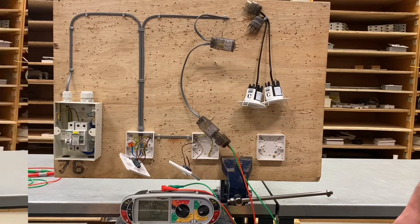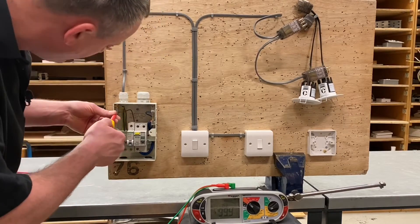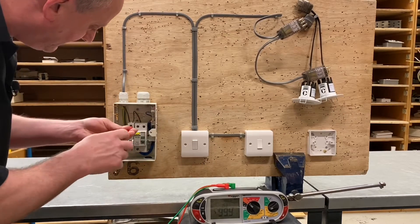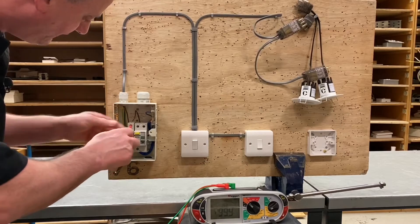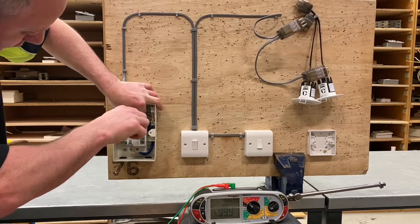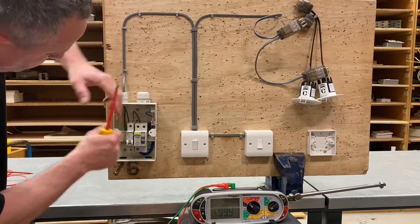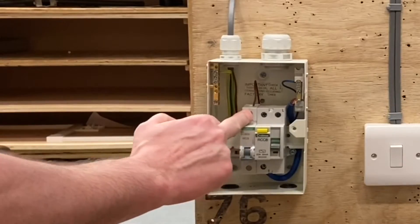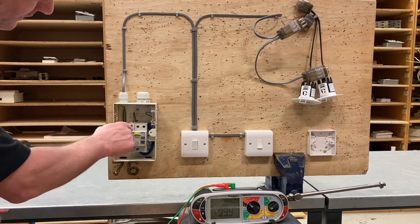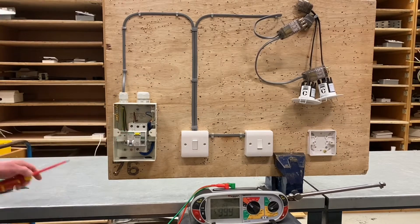With polarity confirmed, we now move to the insulation resistance test. Loads are removed — the lighting points are out — and the covers need to go back on. We pop the line conductor back into the top of the breaker. Normally we'd return terminations to the required torque setting using a torque screwdriver, which is unfortunately unavailable right now, but learners know they must get the torque screwdriver and return it to the correct torque setting. Just nipping it back into position is not correct — that termination must be properly torqued.